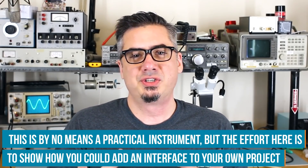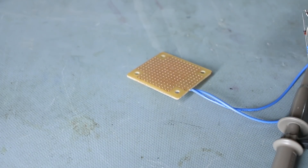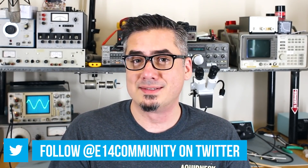What's cool about it is I show you how to interface to a microcontroller by hitting a series of tone bars. We take a physical impulse and turn it into an electrical impulse, then clamp it down so we can safely feed it to a microcontroller. From there we figure out which note was hit and generate a sine wave using pulse width modulation to drive the speaker of our Rubens tube. Hopefully you can take the information presented here and make your own instruments that are probably a little safer and won't burn your house down.